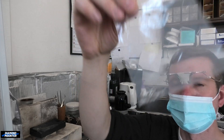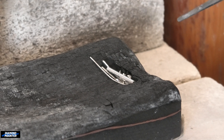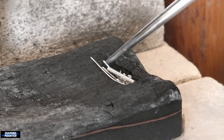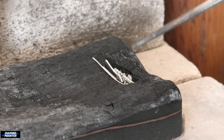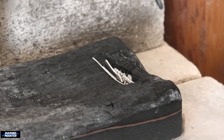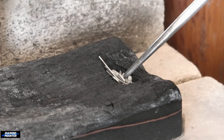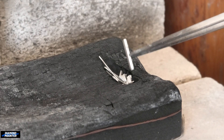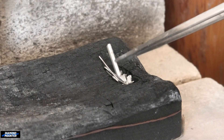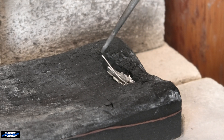So the rest of these little bits will get melted together — I'm putting all my bits in there. I'm going to be blowing the heat from that side, because there's a lot of heat and pressure on the flame and it will disintegrate your charcoal block. Blow it that way, otherwise you'll open up that hole to the edge. Also, a bit like that — that's a useful chunk; you might not want to melt that up because it'll be useful for ring sizings or turning into wire. I'm just going to melt it today so I've got a nice big chunk of platinum.